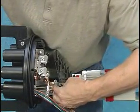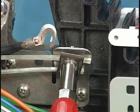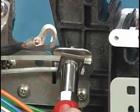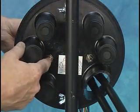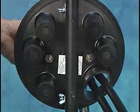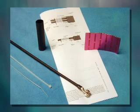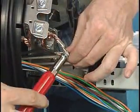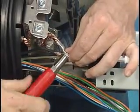Slide the cables into position and attach the strength members from each cable to the metal tower bracket using the square washers. FOSC400 bases are available with or without feed-through grounds. If no feed-through ground is available, ground wires may be installed through a cable port using the appropriate accessory kit. Where grounding is required, attach the ground wires to the cables and to the feed-through grounds.